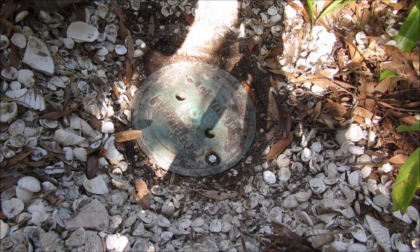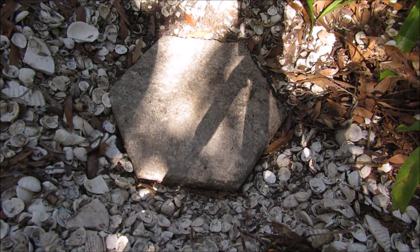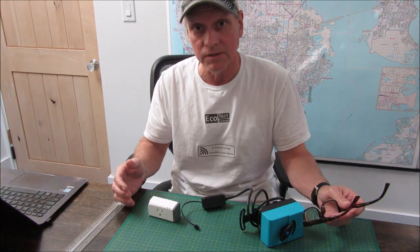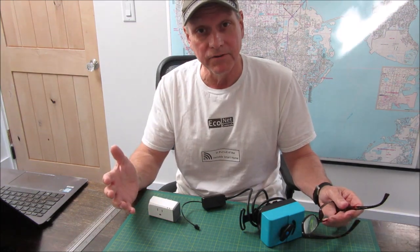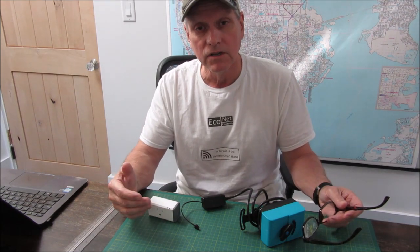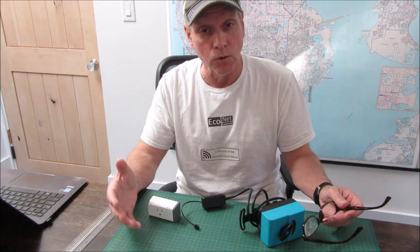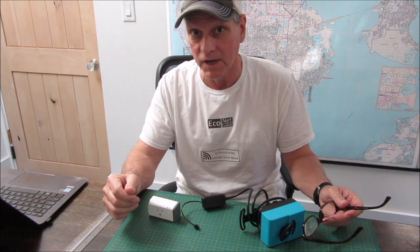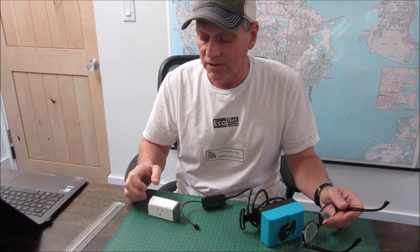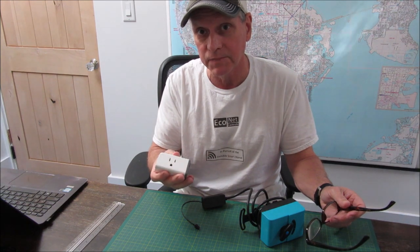We've got the lid back on. I'm going to cover it with this stone, and later I'll cover it with a flower pot. In conclusion, the Bulldog Pro is an excellent leak detection and prevention solution — I'm a little biased, of course. It mounts over a standard ball valve with no plumbing work required. Leak sensors can be paired directly with the controller, so you can set up the system without a hub, without an app or internet connection. The communications use LoRa, which is very long distance compared to Z-Wave and Zigbee standards. Please like and subscribe and look for my next video where I'll install and test a couple lamp modules, including a new Matter device from TP-Link.